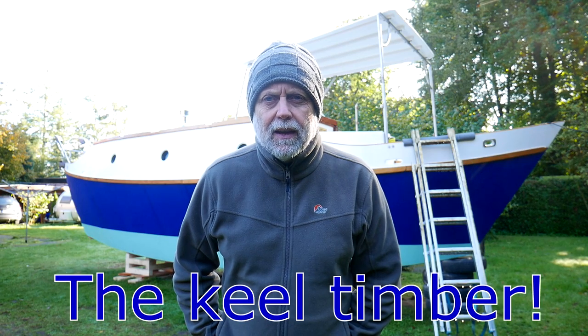And the keel itself is made up of two elements, being the wood section, the deadwood basically speaking, and then the ballast keel, which is a lead block basically speaking, bolted onto the bottom. So I got her up high enough to make a start on that deadwood section, and indeed did that, got the very first small piece on. But there are one or two other little bits going on round about. Let's have a look.